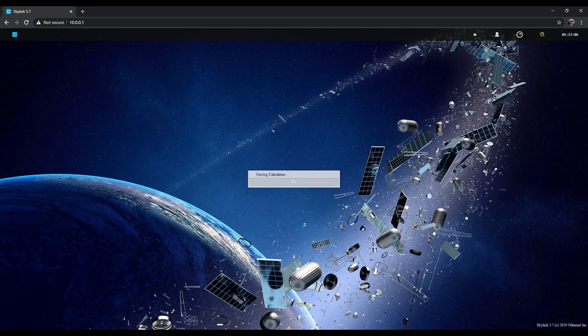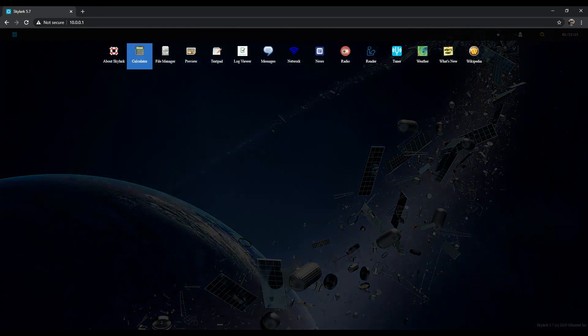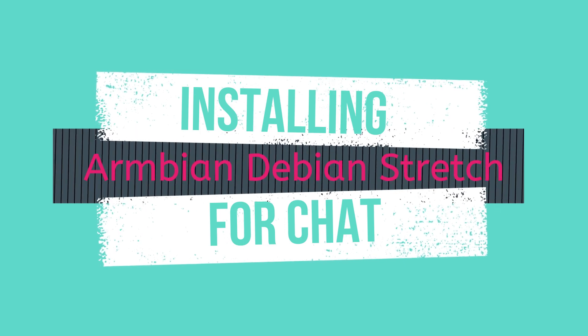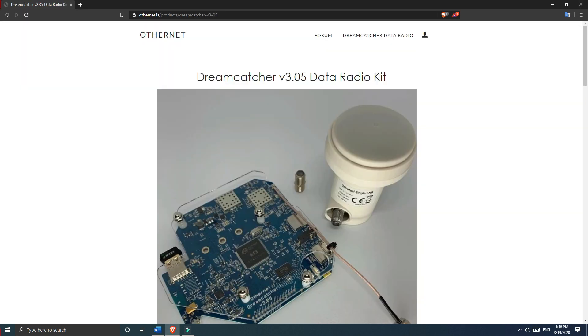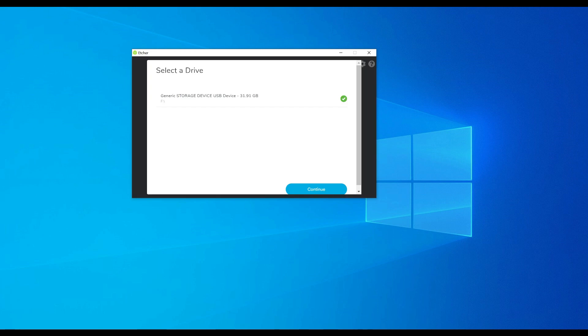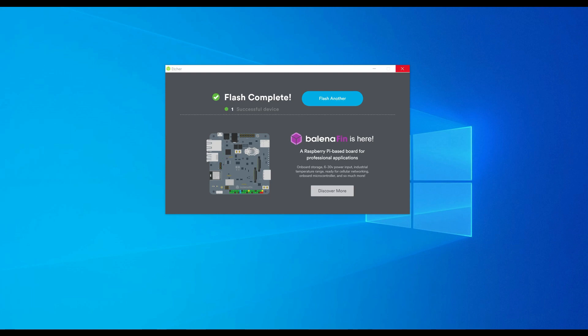Moving on to another fun part of having these DreamCatcher boards. Nowadays you can send text messages with most pro DMR push-to-talk radios, but I still see the fun in being able to do this. Before I get into this part, I have to remind my viewers that this is only intended for licensed individuals and operators. You must abide by all the laws and regulations in your country before executing any type of radio transmission. Now let's head over to the Othernet website — as we did earlier with Skylark, download and extract the Armbian image to an SD card using Etcher, and insert the SD card in the proper slot of your DreamCatcher board.